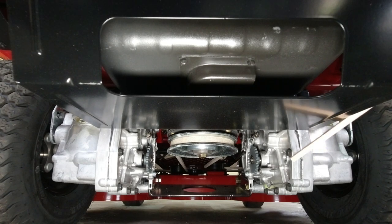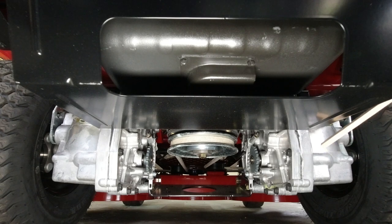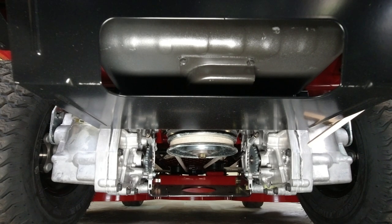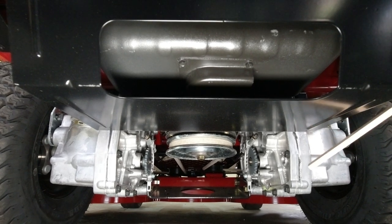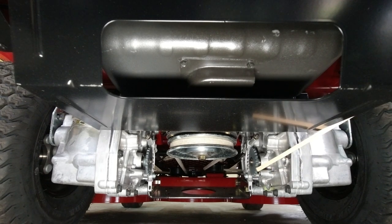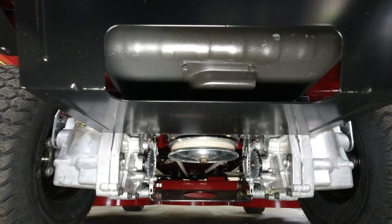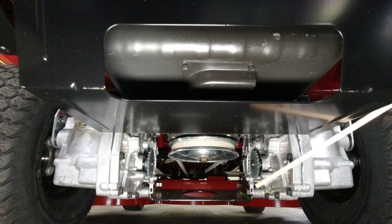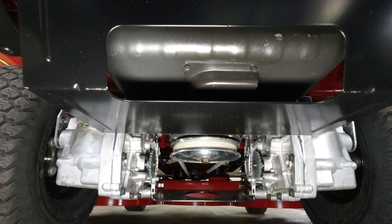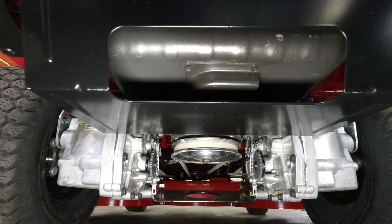Looking at the bottom: there are transmissions on each side. In the center is the pulley for the drive belt to the deck, and above that is another pulley running off the top of the transmissions. The top belt you probably won't have to change more than once every five years; this bottom belt should also last a long time. The small gears here are the parking brakes — Toro uses an electric parking brake, so when you open up the handles, the brake comes down and locks into those gears automatically. Very convenient: open the handles, it locks; you can get off without worrying about the machine rolling, and no extra lever to remember.